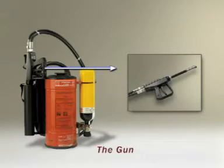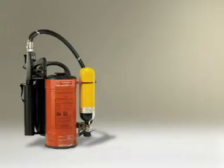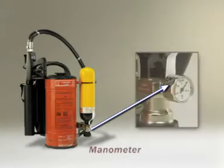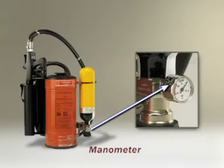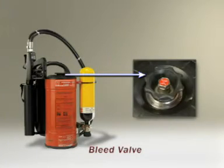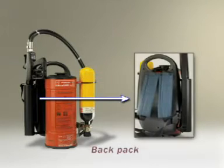In the case of the electrical gun, there is only one mode. The safety valve prevents unsafe pressure buildup in the system. The manometer indicates the pressure of the air in the air bottle. The connecting hoses connect the agent and the air to the gun. The bleed valve releases trapped air in the agent tank. The backpack secures it onto your back.